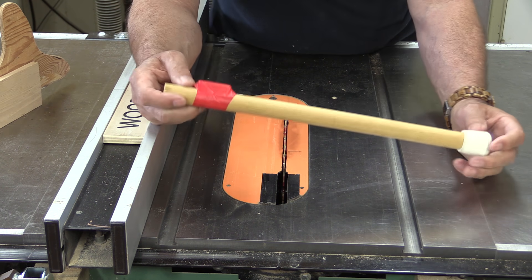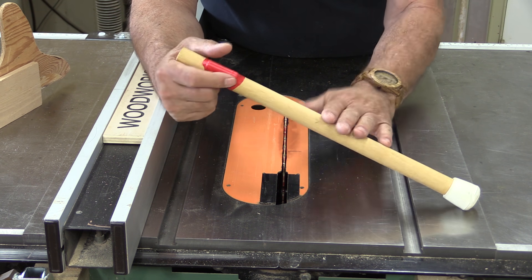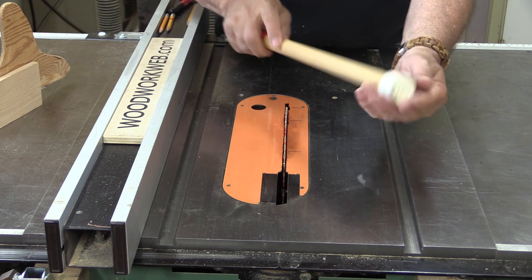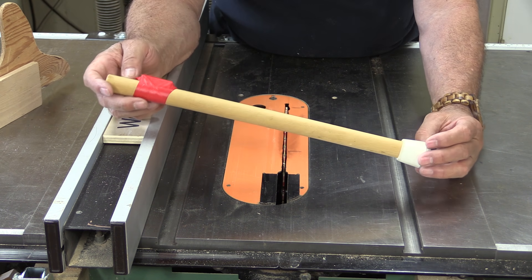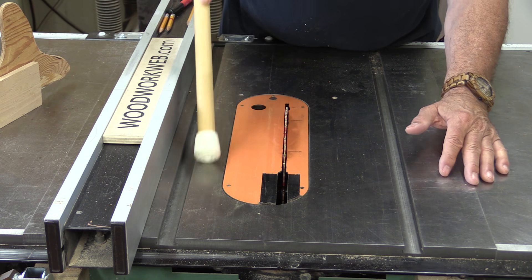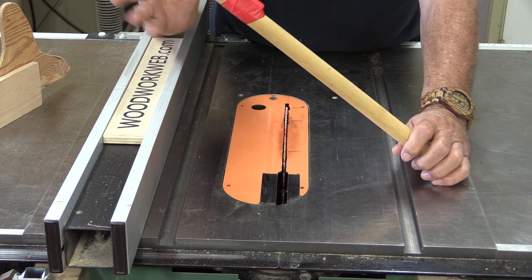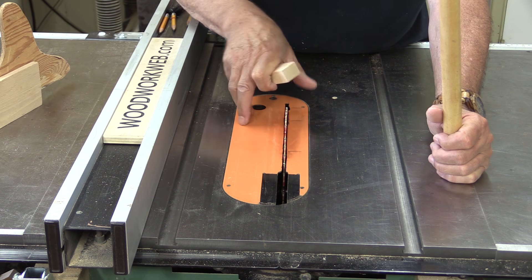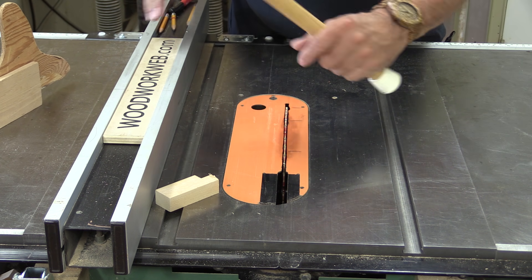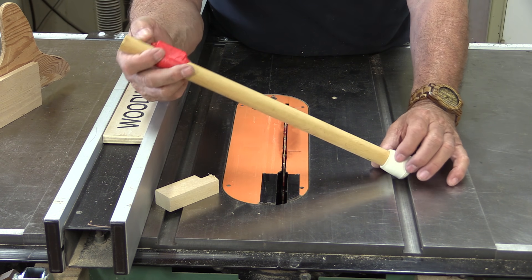This tip is from Terry in Australia. Terry has sent us a few tips over the last few months. What this is, is a push stick with a rubber foot on the end — typically these are used on stools. I'll be honest, I was a little bit reluctant when I made this, wondering how well it would work. But with that rubber foot on there, honestly, it works really well. I don't use it a lot, but where I use it the most is especially when I have my blade guard on and I'm cutting little pieces like this and I need to move them out of the way. I don't have a lot of room to move in here, and this thing works just amazingly well for that.